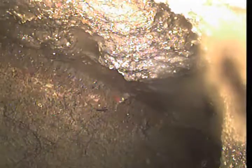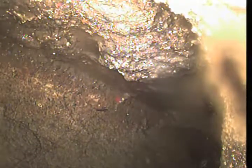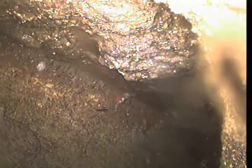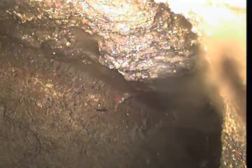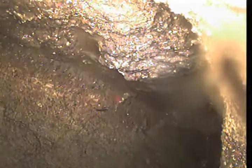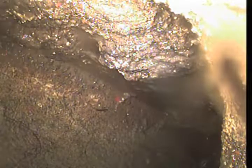So I have water running in the bathroom, and we are not seeing any water. Originally I thought that maybe this was a Y or something picking up the main line for the toilet and stuff, but it was not. Plenty of water running through there, but I was getting stuck about 19 feet in, almost didn't get my cable back out, but you can see we're just into a pit of just rock and lint.